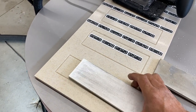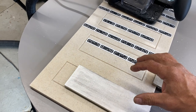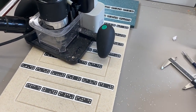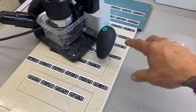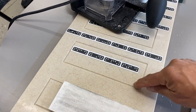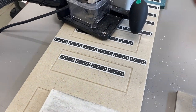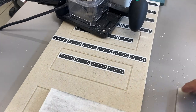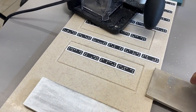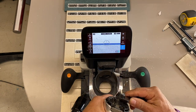That's the first part of these cavities cut. If I place the stone over it or even measure with dial calipers, they look really close. But it doesn't matter — I can always come back and cut it bigger as long as I don't move the tape. I still have my workspace. So now I'm going to do a pocket cut, change bits, put in a quarter-inch bit, and cut on the inside perimeter of all of these. I can even use a different router with a bigger bit to hog out the inside, then start fitting these. If I don't like the way they fit, I can simply adjust it on screen for a few more thousandths and make it slightly bigger until they drop in. That's pretty fabulous. Changing the bit to a quarter-inch — I think this is a down cut, but an up cut would actually work better for something like this.